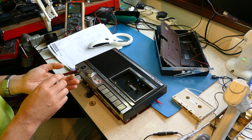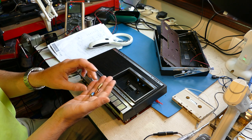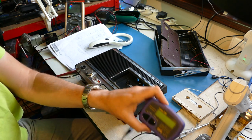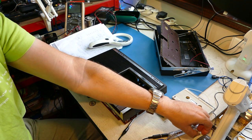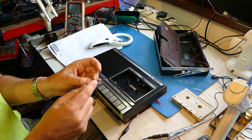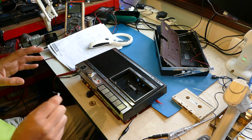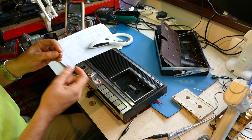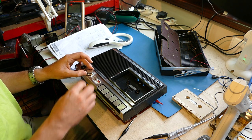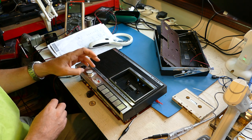I'm just about to start reassembling this, but before I do that, I wanted to mention that these are just some of the electrolytic capacitors I've replaced. I found quite a few of the capacitors in there were leaky — not to say effective series resistance, but the capacitance actually appears high rather than low. It's because the capacitor takes too long to charge because it effectively has a resistor bypassing it. And I was concerned that was going to damage the performance of the amplifier. So wherever I found them I replaced them, although I could have probably replaced every single capacitor to good effect. That would have taken too much time. Now, something I do want to do — this is the tone control, and it also switches the amplifier off if, for example, you're using the DIN sockets. But why that's on the tone control is anybody's guess. This is the volume control.